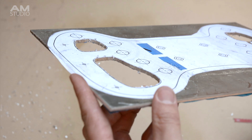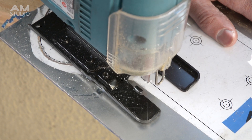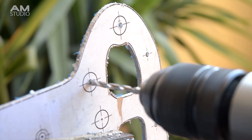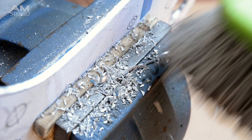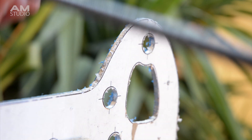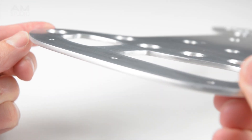With both the inner sections of the handles cut out we can start cutting around the outer edges of the template creating the main shape of the wheel. Next we can drill out the mounting points and the button holes. Flat and round files are used along all of the edges to remove any sharp spots or cutting marks.